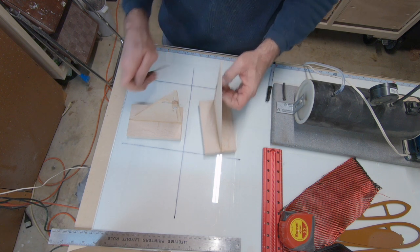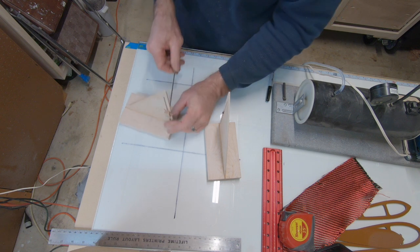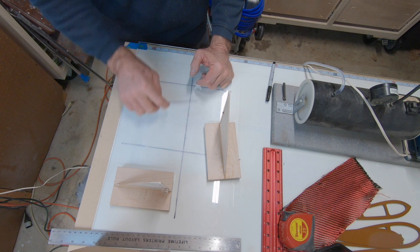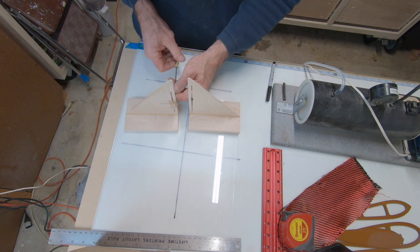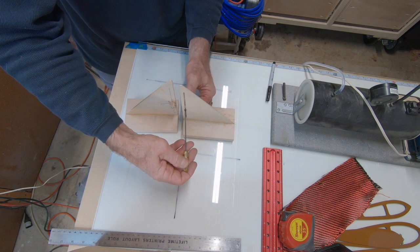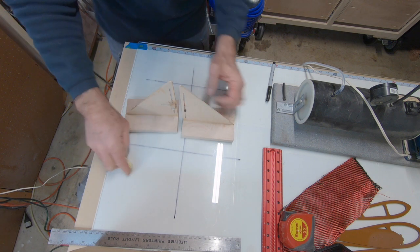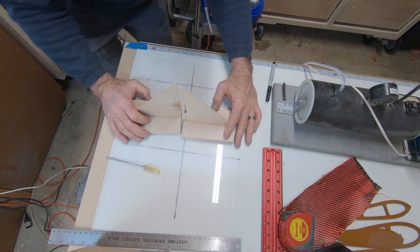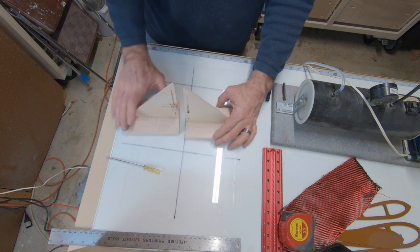So you'll take one of these jigs, and you'll go off of that fuse center line where the wing is going to go, and you set this pin exactly where that center line of the wing is on the fuse. And then the other 7 jigs, once you set this, you can set the other 7 off of this one, and you can put those pins exactly on top of each other. And when you sight it in and adjust all the height gauges, you make those pins off of this one the exact same.